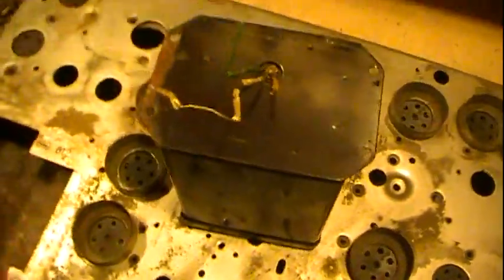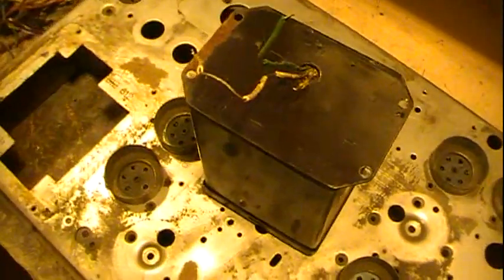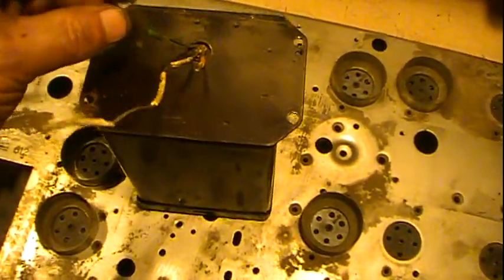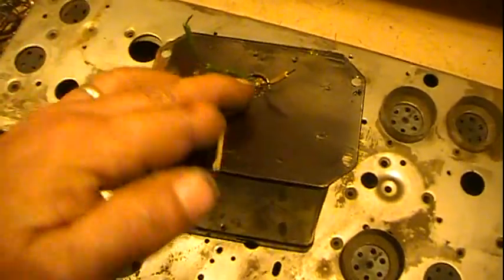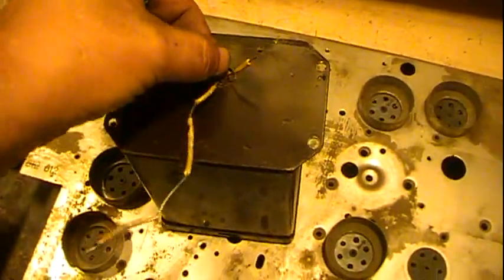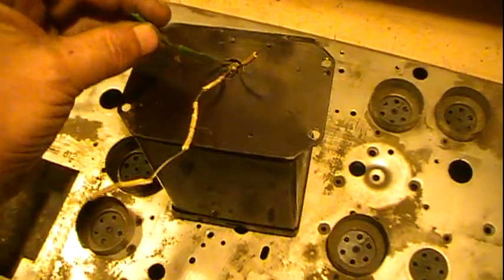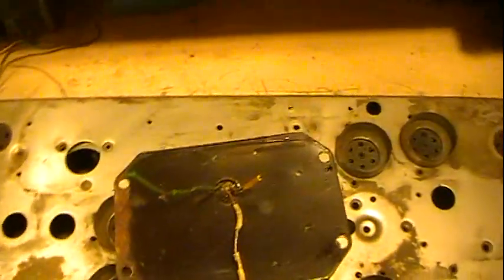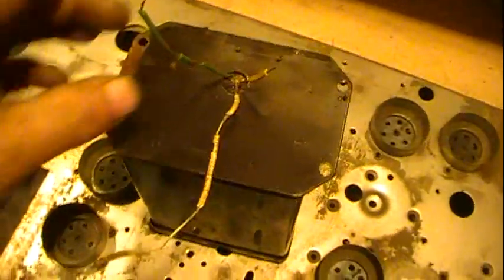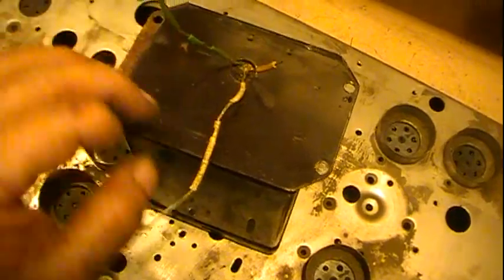Some of the other little dilemmas dealing with this: here's the power choke. It's actually a single choke center tap, but it'll show on the schematic as a dual choke. I've yet to print the schematic off, because there's going to be some things I want to show on it as we go along. But deep inside, the insulation is broken down deep inside, and I haven't decided for sure what way. I may just use liquid tape, or probably more likely — since I'm out of liquid tape — use Corona Dope. It's overkill, but it's a little thinner material than the liquid tape and it may get down in there.